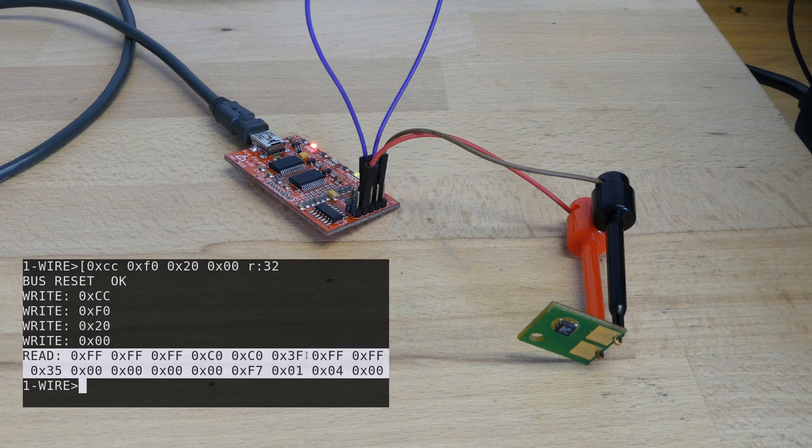And this corresponds to the data we saw in the trace at the beginning. Now, we want to read out the key, and the key is stored at address 0x80, hexadecimal 80, and the datasheet says you shouldn't be able to read it. But maybe the guy who implemented the datasheet did a mistake and didn't put this protection on. Or even more, because this is not an original DS2432, the one who did the clone or the ripoff also forgot to do it. Or maybe it's just a rebranding. We don't know, but we still have to check it to ensure that.